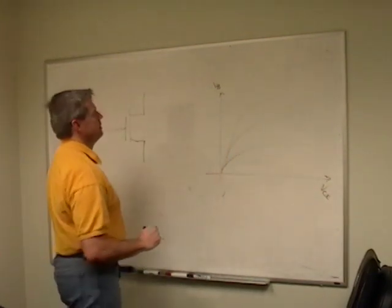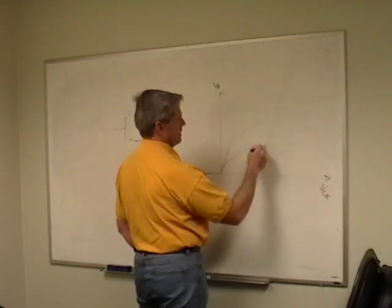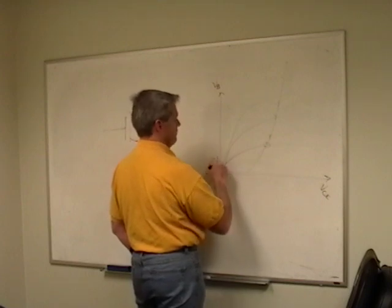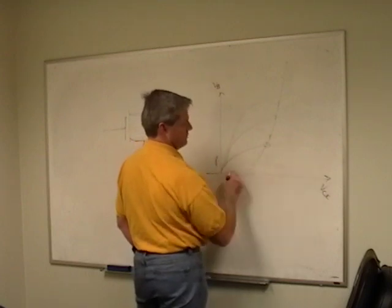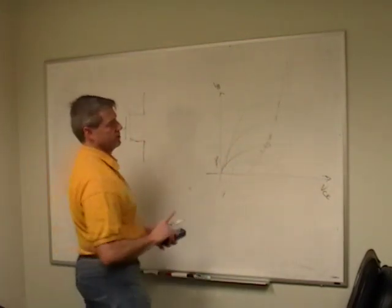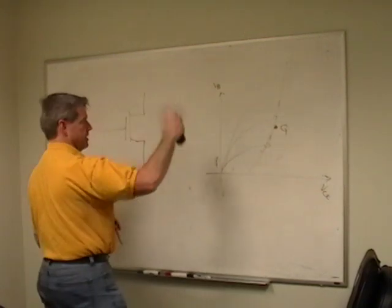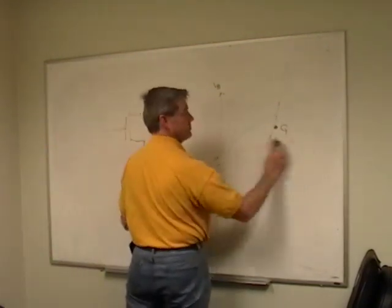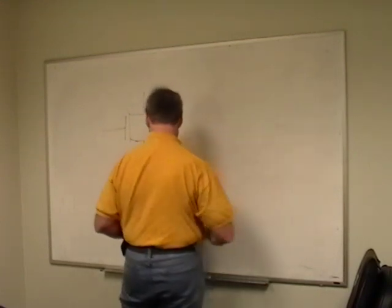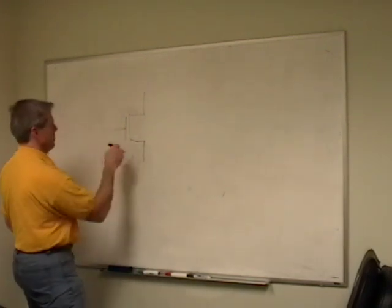If I remember right. So now we have this array of things where we can plan our circuit that we can get amplification out for a very small VB in. I can get a very large VCE out. And that's how my amplifier works. And I'll set up some quiescent point here, or Q point, and we'll operate around that. But again, there's those parasitic capacitors and things like that in there that are keeping it from running as fast as we want. So, again, back to power.